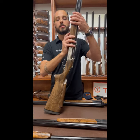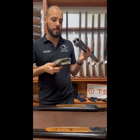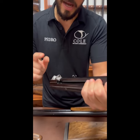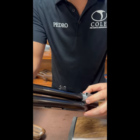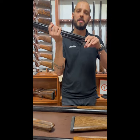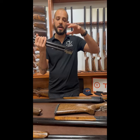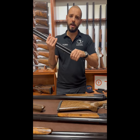Another option is I can make the gun even lighter by asking for a light monoblock. What they do is drill out holes on both sides of the barrel to make the monoblock lighter. If I want to increase the weight in the middle instead, I can ask for the monoblock not to be lightened, and you'll have more concentration of weight right at the receiver.